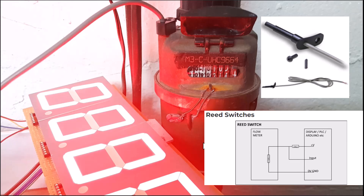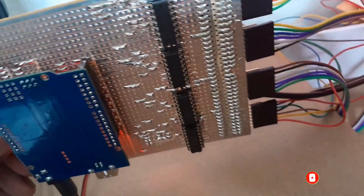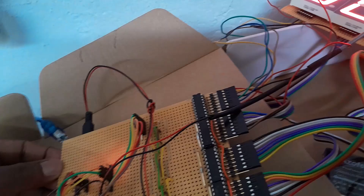It's important that if you have this in your circuit, you need to ensure you've got a pull-up resistor, otherwise you're going to get a lot of noise induced based on the magnetic coupling internally with the reed switch. The driver here is mostly the ULN2003, which is a seven-segment driver that can also drive a couple of devices because it amplifies the current.